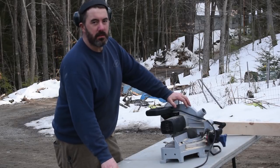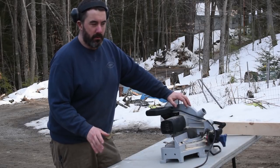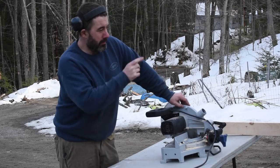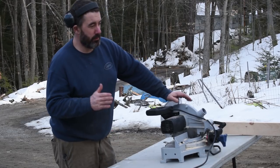So the base of this chicken coop is gonna sit on four by four legs, and then I'm probably gonna do two by four legs in the center. So there'll be six legs total, but the four corners will be pretty much holding most of it. I wanted it to be pressure treated because it's gonna sit on the ground. I'm gonna take these and cut them to 2 foot sections to make the legs for the coop.